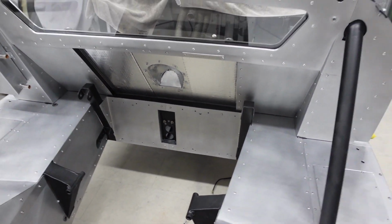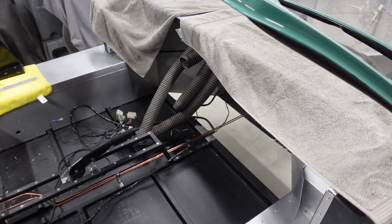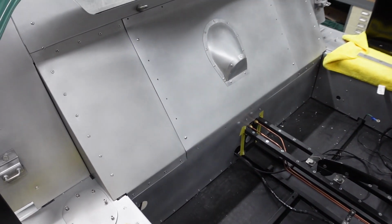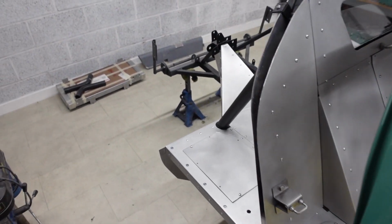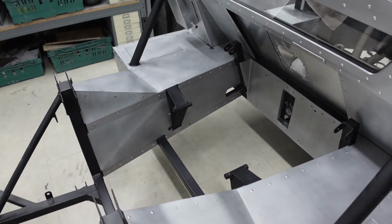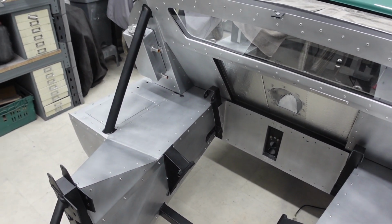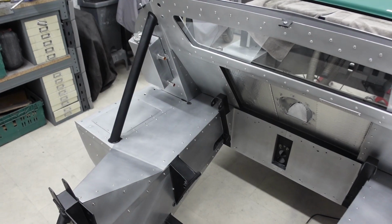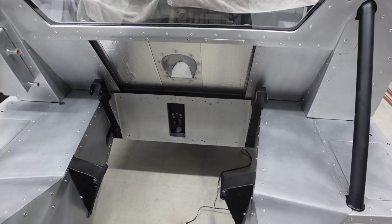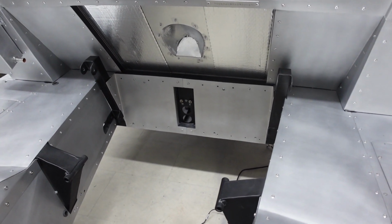And that is basically because the wiring loom runs down the centre of the car. The main portion of the loom splits off and runs down the driver's side chassis. But what I wanted to do was split off a small portion that feeds the necessary bits and pieces on the passenger side. So that splits off.